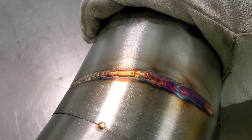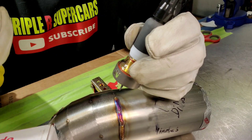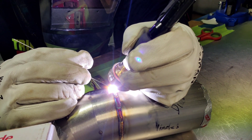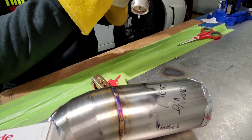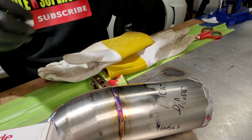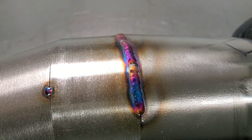And I can show you what it looks like if you pull away too soon, while it's still extremely hot — you're going to get a very blue looking color. Red hot, red hot — pull it away. There you go. That is a darker color bead whenever you pull away. I'm going to give you a close-up on that. It's got a lot of blue in this one. You get the purple, the violet purple, and then there it is — the blue. An early pull away.